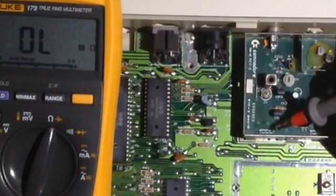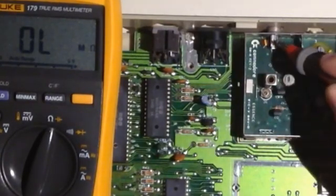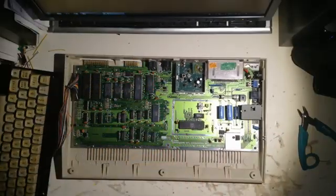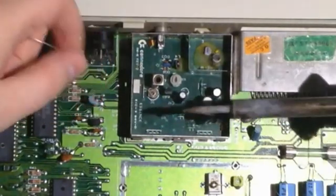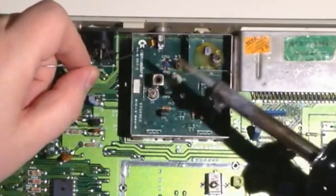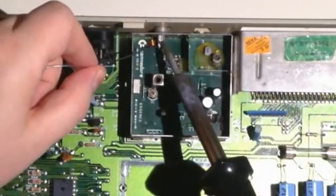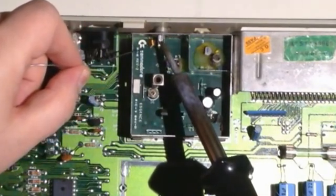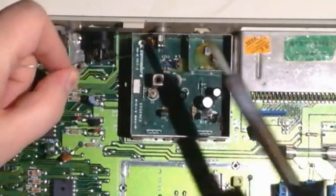What we can do is put the wire from here to here. Let's do that now. There we have the tin on that pin, and this connector already has solder on it. You can tin it — put some tin on it and make it clean. Here I have prepared a cable. This cable here is a single core — it's the ones that are used in breadboards, jumper cables. The nice thing about that is it won't flop around.